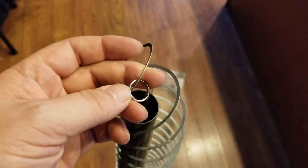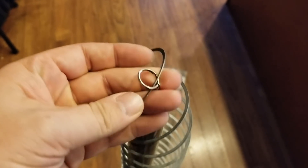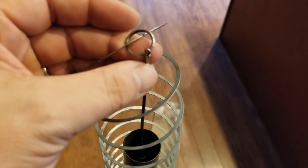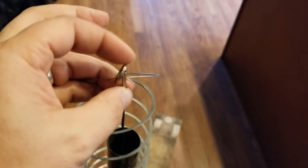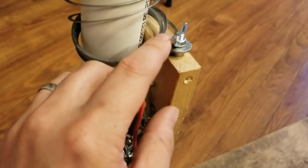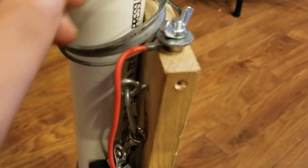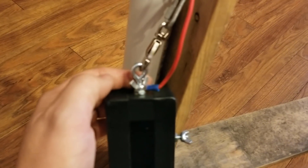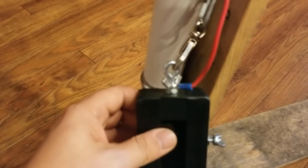I've got the end of the slinky ran through the key ring, which is ran through the eye hole at the end of the fishing pole — this is how it's secured whenever it gets raised up. The slinky runs down the pole and is connected to this nub with a ring terminal, and it is connected to the 9:1 unun with 14-gauge wire that has a little fork wire terminal connector on the end of it.